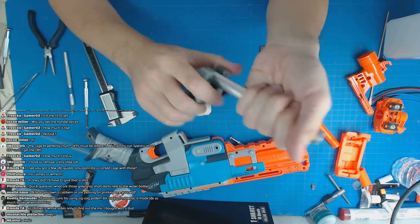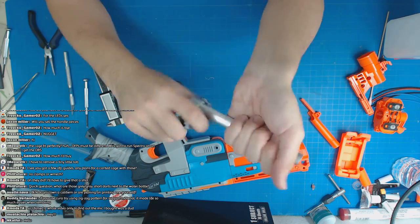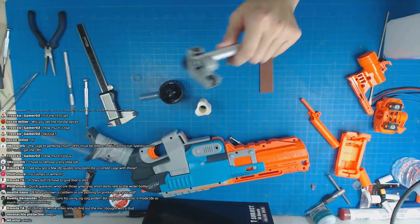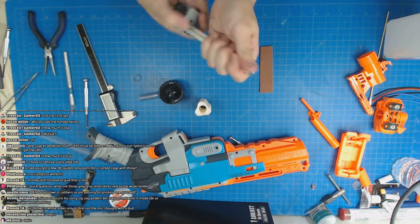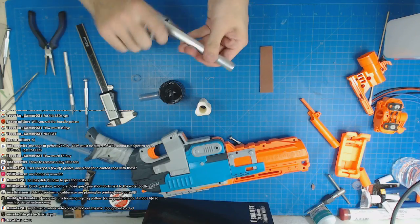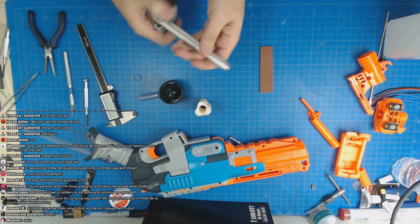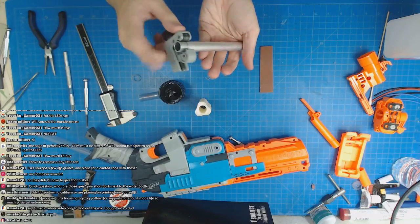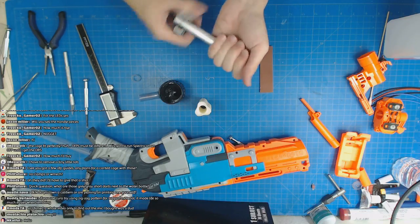Do you think running brass through a bandsaw is a bad idea? Because usually I use this pipe cutter, but when I use it on the 9/16, it pinches it a little bit. Well, when I use it on any brass, it pinches it a little bit. But specifically the 9/16, because I plan on eventually using 9/16 for a breech to fit it over 17/32. But if I do that with this, it's going to pinch in and it's not going to slip over there as easily as I want to.